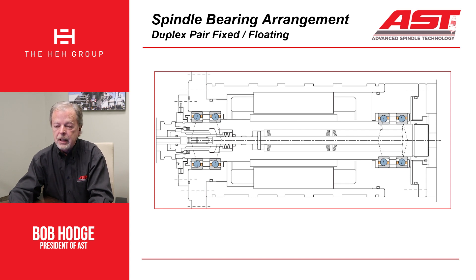The back bearings don't transmit any axial reaction. So what you're really doing is every time you do a tool change, you're loading this bearing statically — because the shaft's not rotating — and you're unloading the number one bearing every time you do a tool change. If this is a 15-degree contact angle bearing, you can be overloading that bearing. So oftentimes, if we find a 15-degree contact angle bearing there, we will increase that to a 25- or even a 30-degree contact angle bearing to better withstand those forces.